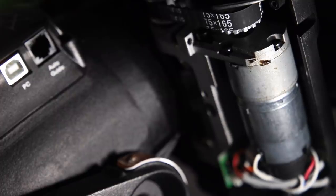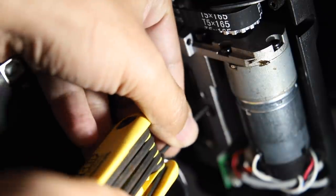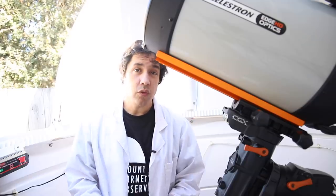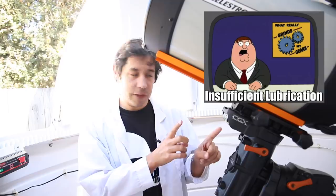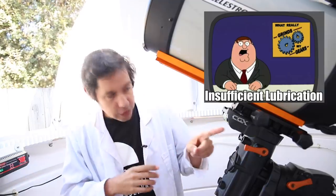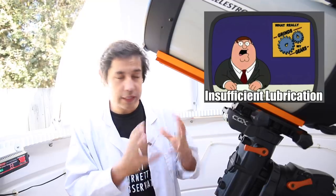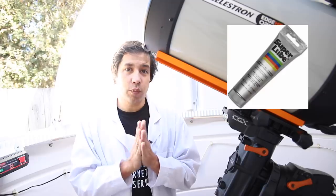If the screws bind when you're turning them, they suggest that you back out the screws, clean the threads and the holes. Dirt or shavings can make it more difficult to adjust. And whatever you do, do not use WD-40. As tempting as it is to just squirt in here and fix that, don't use WD-40. Putting WD-40 in here will actually degrease what's in there, and you're essentially mixing greases as well, which is a problem. They recommend you use something called super lube.